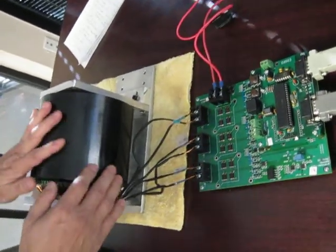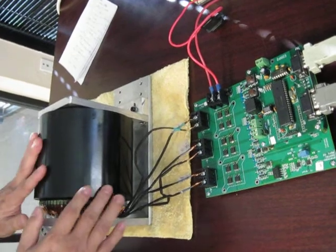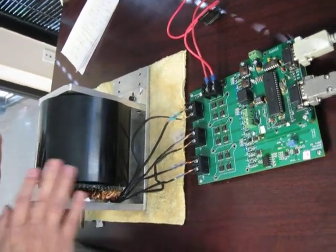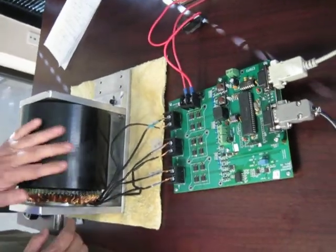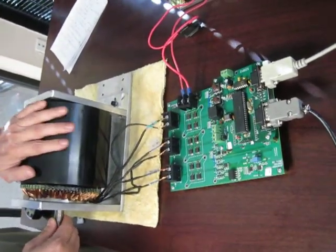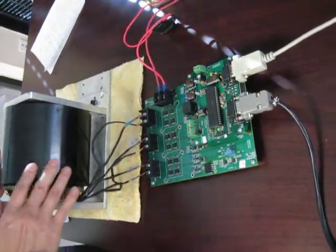The motor itself has a rotor on the outside connected to the shaft, and a stator inside. It doesn't have any moving parts, doesn't have any brush, no sensor, no Hall sensor, no encoder — just the motor itself. Very simple to build, easy to maintain, and very reliable.